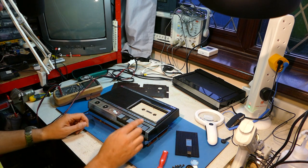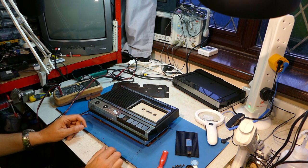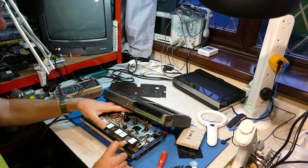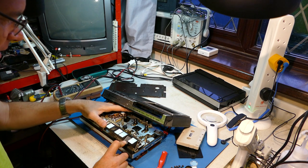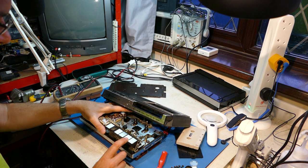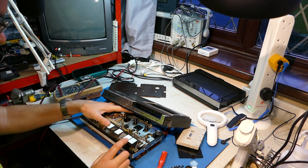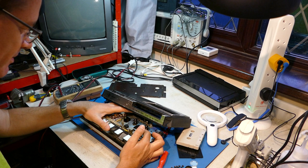I think what we need to do is have a look at how the motor connects. Because when you press one of these buttons, you will connect the motor across the supply. The first thing I've just found out is pressing that with the motor running in this particular direction makes the spool turn that way. So that must be the direction the motor spins in. It'll go the other way with rewind selected. Yes. And with start — which is, I think, that one. It won't engage without a cassette, I think. You have to make it think there's a cassette in there. And we can see the take-up spool and capstan all working. So mechanically, it seems to be working quite nicely.